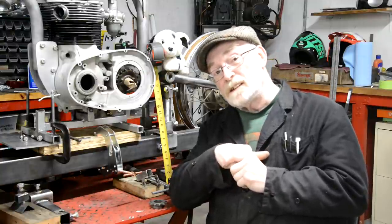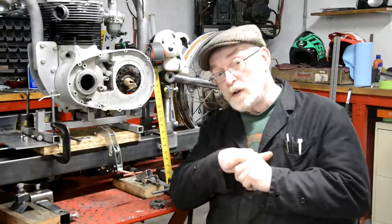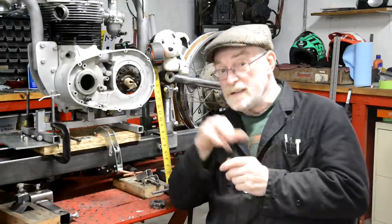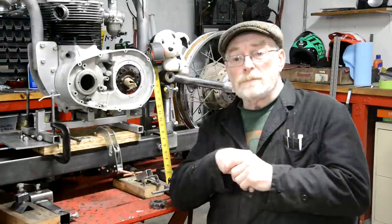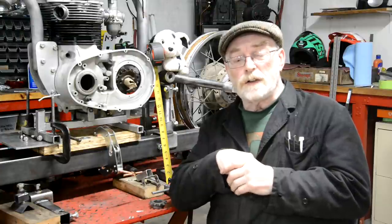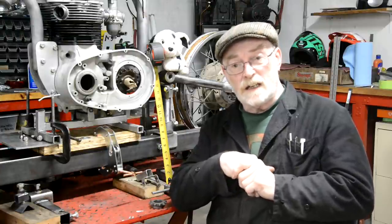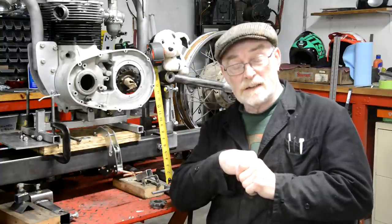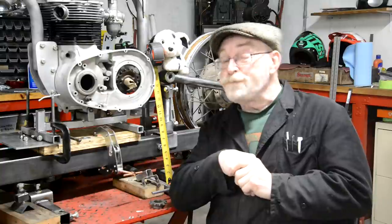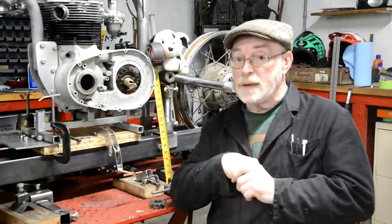I had a word with my friend Dick, who I've mentioned before, machinist extraordinaire. Hello, Dick. And he confirmed what I thought. He mentioned the type of steel it was and what have you. It was just a little soft and gummy. And he recommended I run it at 500 RPM for that diameter.